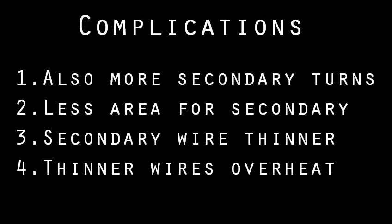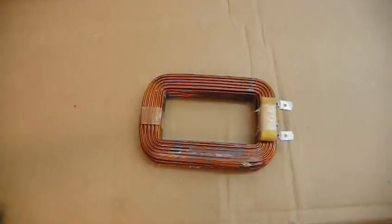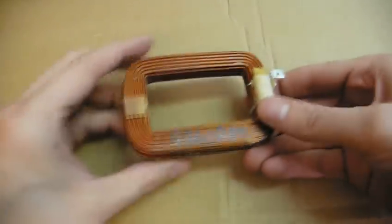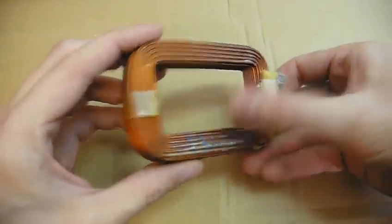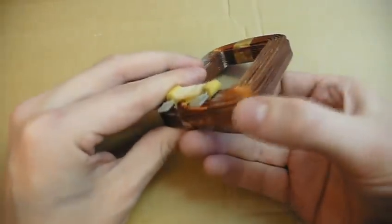The primary's wire will generally be 14 or 16 gauge, and if you're careful, you can just cannibalize another MOT primary for wire and solder it together. If you have another MOT project where you're not reusing the primary, that would be a good candidate. To add extra turns, you'll need to find a terminal that's connected to the outside winding on the coil, join the new wire to the old one, and continue wrapping in the same direction.